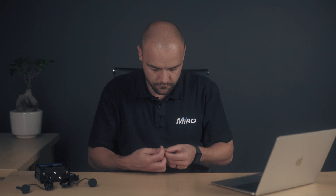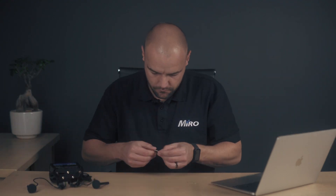You will notice that there are SIM card adapters inside of the box for nano and micro SIM cards. Just make sure that you use the correct SIM adapter for your SIM card. I've connected the antennas for LTE connectivity, I've installed the LTE SIM card, and I've connected the internet cable to the WAN port. This device should still be connected to the RMS platform.